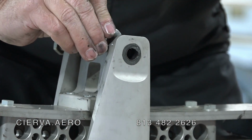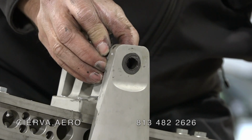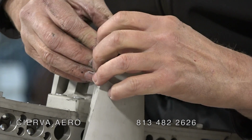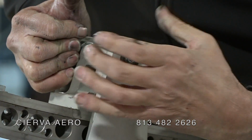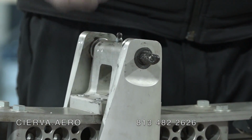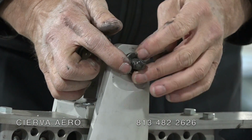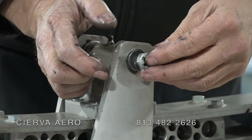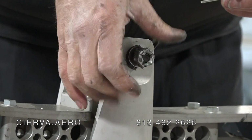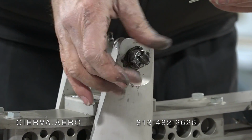Same thing, I'm going to press it to the side, push it down to get it to come up, slide the washer in, and then once it's in, again just push down on the blade a little bit to get it to slide in. And it goes in almost like magic. Nice. And then washer, and then nut, and then cotter pin. And we just do a simple bend on the cotter pin. I'll show you what it's supposed to look like here in just a second.